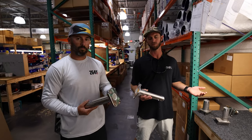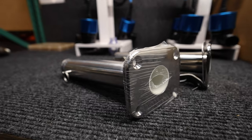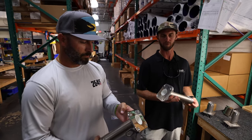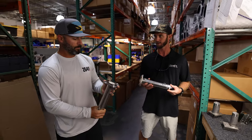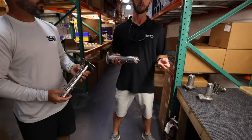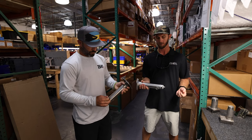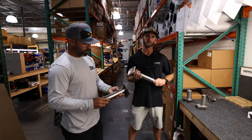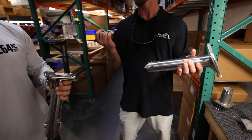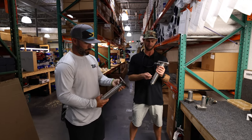Not only do we offer pumps and sea chest systems here at Hooker Electric, we also offer commercial grade swivel rod holders for the commercial fisherman or everyday swordfish fisherman. This is a zero degree rod holder and this is a 15 degree rod holder — depending on your preferences you have the option between both. They're heavy duty and commercial grade. This little nut lets you adjust the tension of the swivel — if you have big heavy reels you can tighten it down more, or for a standard everyday 30-wide hand crank you can let it swivel freely. There's also a clip and pin to hold it stationary if you don't want it spinning.